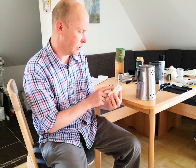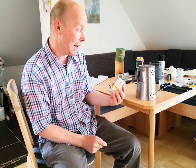It wasn't very nice. So I looked into this, thought, are there high temperature magnets? There are higher temperature magnets. I found these from Magnet Expert. I'll put a link in the description, and these are called samarium cobalt magnets, and they can survive at a much, much higher temperature than ordinary neodymium magnets. So don't bother with the neodymium magnets, they won't work. The one at the bottom might hold, but the one at the top won't. So there you go. Hopefully that's the solution. I haven't actually tried it yet.